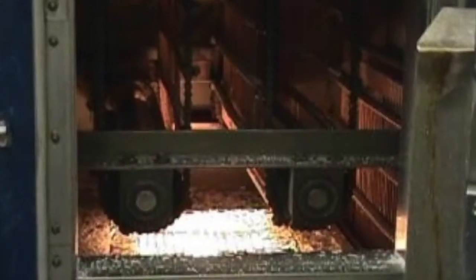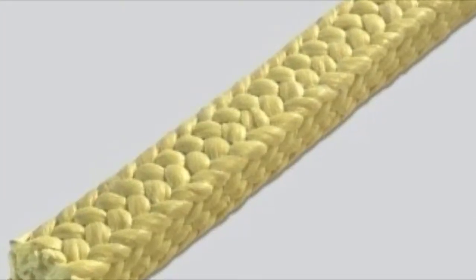The quality of the pump packing being used also affects controllable leakage. Some issues to consider are the purity of the materials, and the density and gaps in between the strands of the braid. This is based on the braiding machine's weights and tensions of the fiber during manufacture.